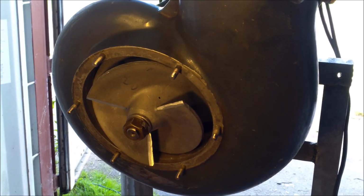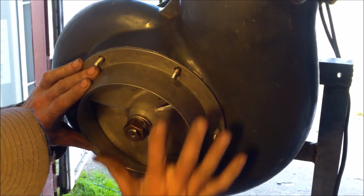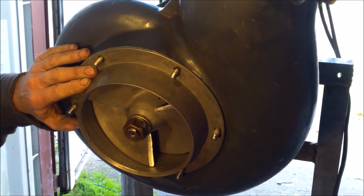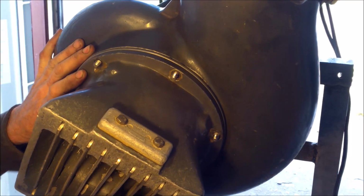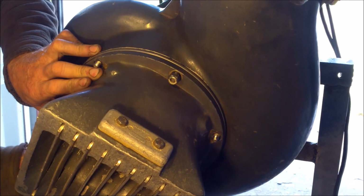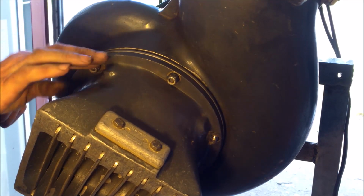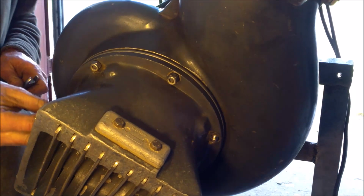Okay, now liner, back. Okay, I try to center it a little bit. I take my water intake, put it in place, and then my nuts. There's 6 nuts. I put 2 opposite, and like this I can have my 2 hands free. So it's especially important when you have to do that on the river. It's much easier if you put 2 on the opposite, and like this you can work absolutely freely.